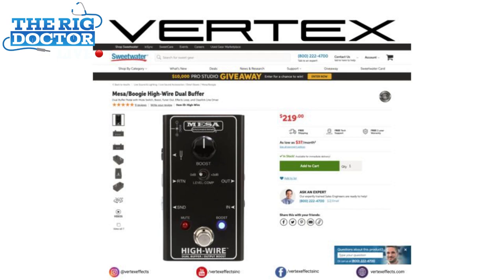There are different colors on those, and they may not always be the sound that you like, but a lot of people that use those pickups tend to like the sound that they produce anyway. So that's just a caveat. If you did have a high quality dual buffer, say like the Mesa Boogie one, with an input and an output buffer already built into it, so you wouldn't need two separate buffers, it wouldn't hurt to use something like this. But a lot of people, if they're trying to save a few dollars, could invest in their EMG pickups as their input buffer, and then their output buffer could be something like the Bonafide, if they wanted to save a few dollars.